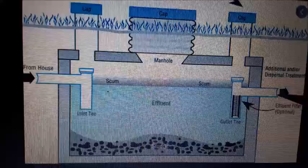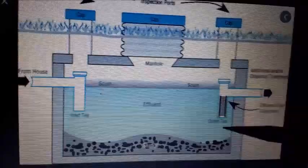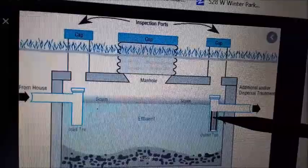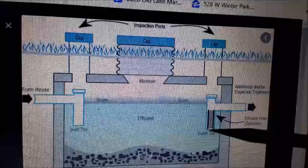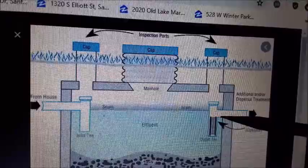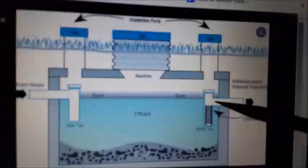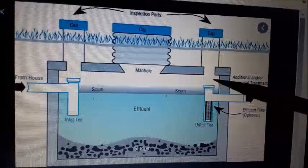To get the most life out of your drain field, instead of a T you want an elbow that just goes straight down — that way solids and scum won't pour over the top into the drain field. Here's a picture of a newer installation with a filter on the exit side of the septic tank. I do not like this setup myself. The sludge layer in the bottom builds up over time, and when it gets up to the bottom of the low-hanging T under the filter, water can no longer exit through the filter, the water level in the tank rises, and scum pours into the drain field. Using the down-curved elbow without an open top means if your water level rises slightly, solids won't start pouring into the drain field.